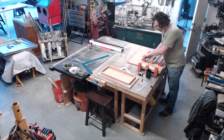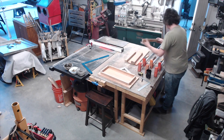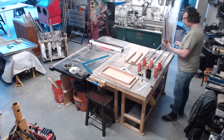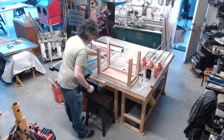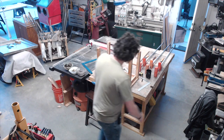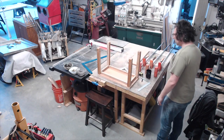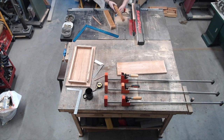Let's see if these actually glued together — they've been sitting for an hour, which should be enough time to cut them. That's kind of roughly how it looks, upside down. I'll clean up the legs, see how big they actually are, and go from there. I've trimmed the width so they're exactly an inch and a half wide. Now I'm just going to run a millimeter off the edge to clean these sides up and then they'll be exactly an inch and a half all the way around.